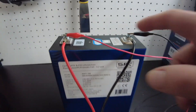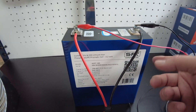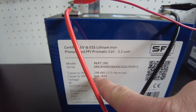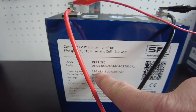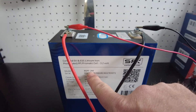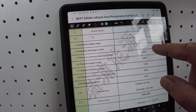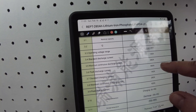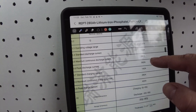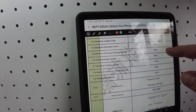However, I'm not going to be able to do that on one cell because the equipment I've got is only going to allow me to pull maybe 25 amps from this cell, and a 0.5C on this cell would be 140 amps. Standard discharge current, they say 140 amps. Maximum continuous discharge current, you can do 280 amps. Ideally you want to do 140 amps or less, but you can do 280 — you may wear your batteries out faster, but you can do it.